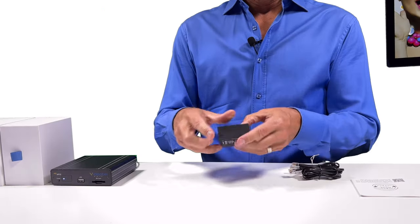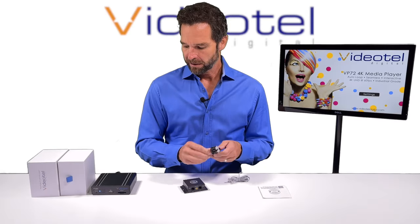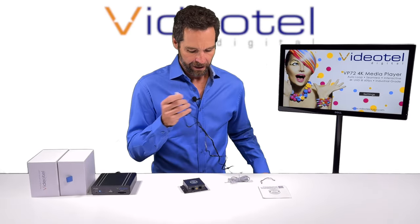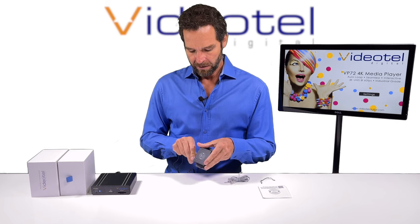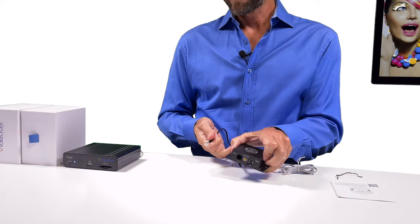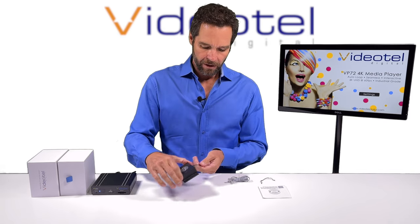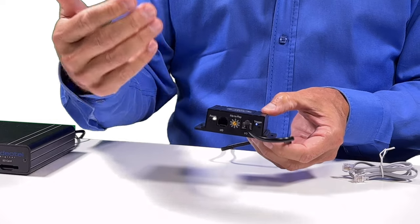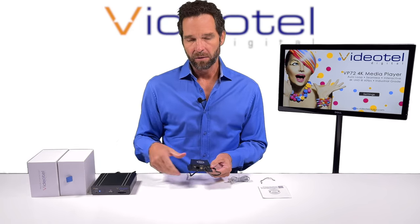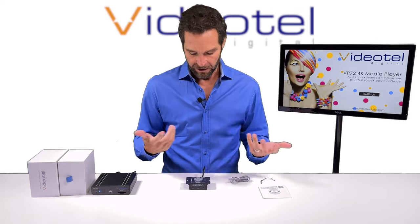The Wave2Play basically has two sides. On one side we have some I/O ports where you connect the device to the media player and also to other players — it doesn't matter which port you choose. The cable has a large connector on one side and a smaller one on the other, and we connect it to the interactive media player. On the other side, we have the two connectors and a dial. The dial is currently set to 001, which means when triggered, it sends a command to the player saying play video 001. That video is set up on your media card — the SD or USB you have in the player.